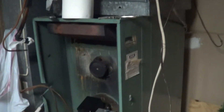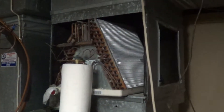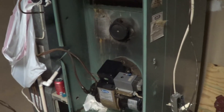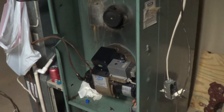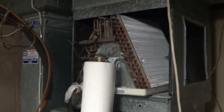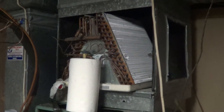This will be what's called a hybrid system. The way it's going to work is heat pump is going to be priority, which would be stage one. And in stage two, we'll go to fuel oil. I do an interlock so that I don't ever have hot air from the furnace blowing on the evaporator when the heat pump's trying to run, because that would cause a high head pressure condition.